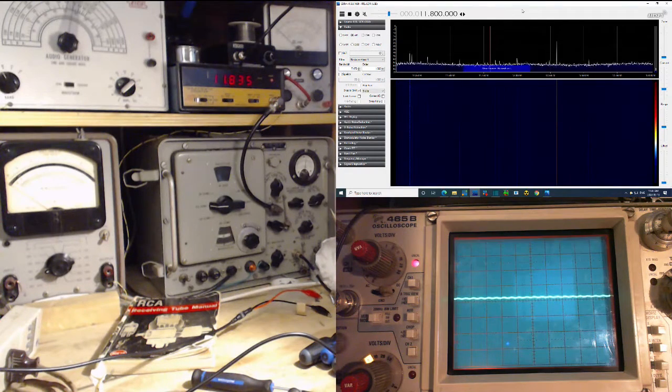But if we pretend, oh, that's not right, it should be below. Wow, that's actually, you know what? It doesn't matter how much you tune the radio. I don't know if you can move that local oscillator that far and make it on the other side of the input signal so it matches all the rest. Why would they have one band above? It's not even the top band or the bottom band, it's in the middle. And all the rest are below.